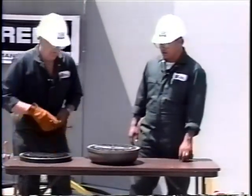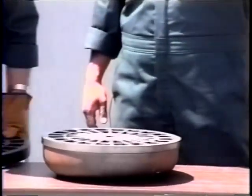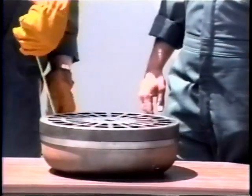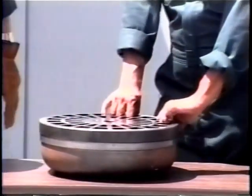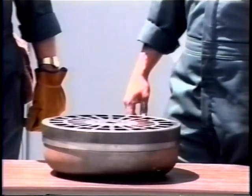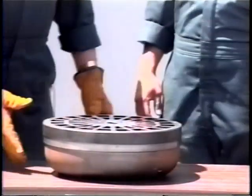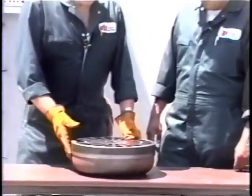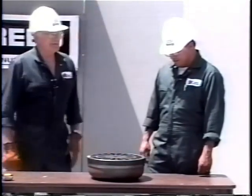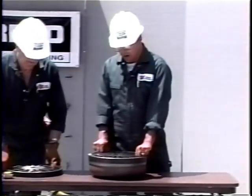Next is the 20-pocket. The bowl itself is 4 inches deep; the bowl and plate together come to 5 inches deep. This is again a very smooth output bowl, ranging from 6 to 9 cubic yards per hour, with CFM from 365 to 450. The deeper pocket gives you approximately twice the material per minute compared to the previous setup, mainly because the deeper pocket holds more material. This is one of the most standard bowls used for a very wide range of applications.